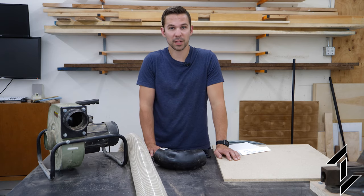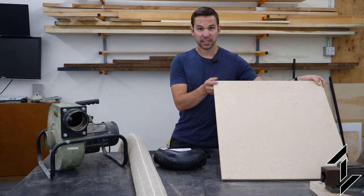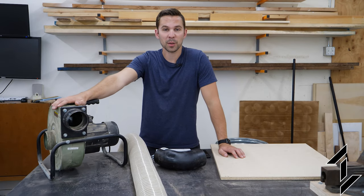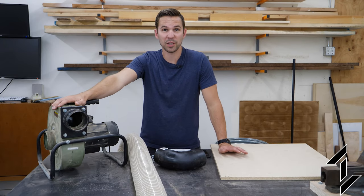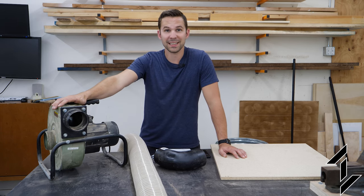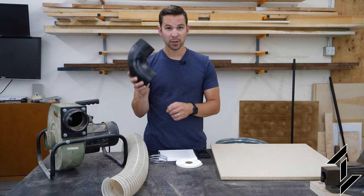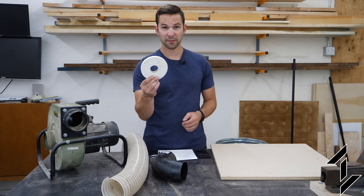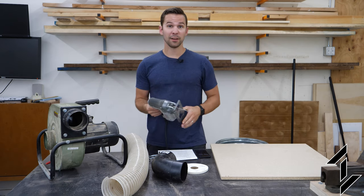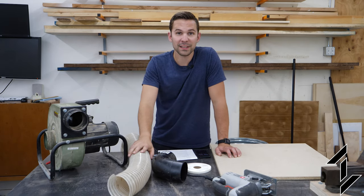In order to build this, we're gonna need a few things. A trash can, a board that can fit entirely over the top of the trash can, a blower. Now you can pick these up at Harbor Freight for about $110 with the coupon, or if you keep an eye on your local Craigslist or marketplace, you can often get these for less than half of new price. You also need a dust collection hose, two right angle fittings, some weather stripping foam tape, some sort of caulk, and a few tools, namely a jigsaw and a router. Links in the description below for all of these things.